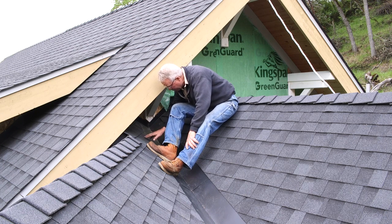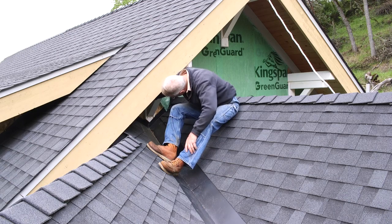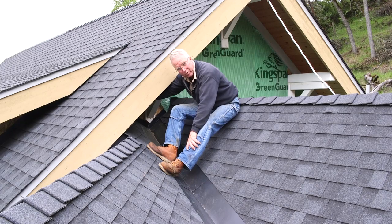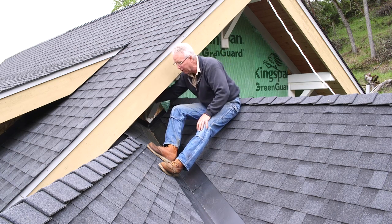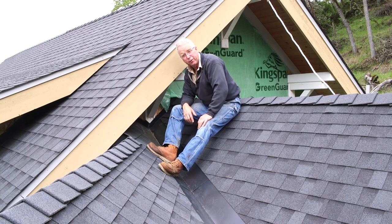But this roof diaphragm runs clear up until it butts into the bottom of this overhang. It is flashed, it is caulked, there's step flashing, roof to wall flashing, and besides that, there will never be any water up here that doesn't come out of a pigeon when he builds his nest in this spot. It is perfectly dry, and if we have a 1,000-year snow event and there's ever a snowdrift laying here, any water that gets in here is going to end up in this valley, just like the water that falls out of the sky.